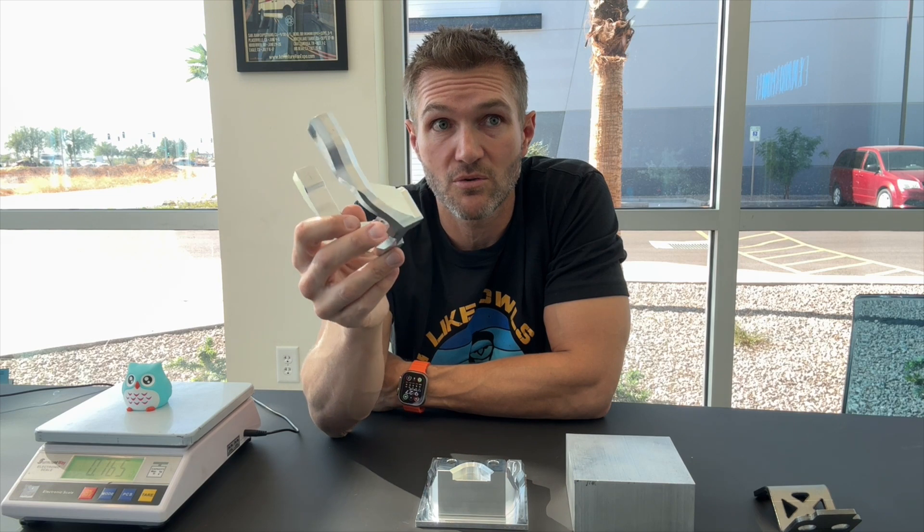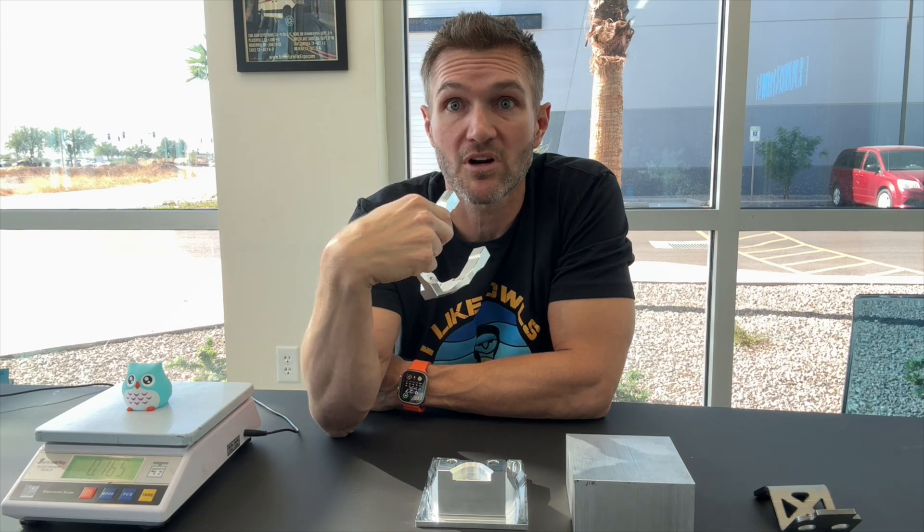There's also a cost difference. This laser cut part probably costs me a few dollars and then a few bucks to powder coat it. This machined bracket — close to $40 per bracket just for this part. So adding these to a ladder tire carrier is an additional roughly $80 or more once you anodize it in our cost. I wanted to walk you through why we make these decisions, especially when it impacts the price of a product.